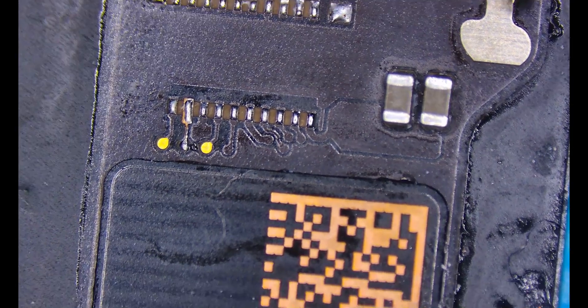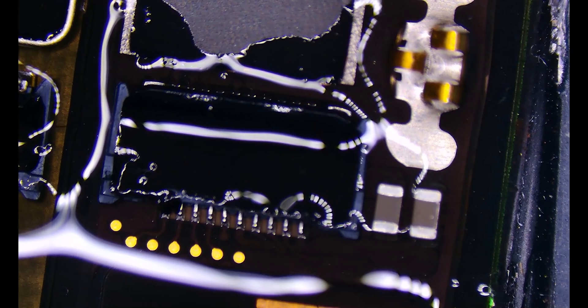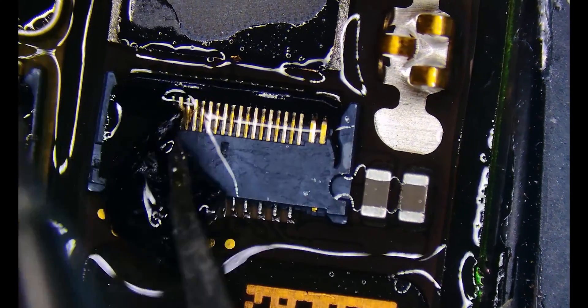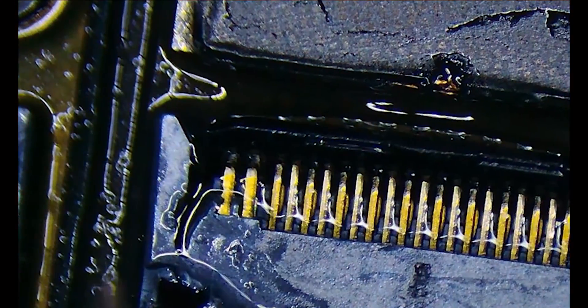If you're liking what you see then smash that like button and subscribe if you haven't already. Looking good, so I'm going to get our new connector — I'm actually going to steal this from a broken display. These connectors aren't something that are readily available, but I do enough watches that I have access to them. Adding isopropyl alcohol I'll be able to carefully remove the sticker and pull it away so that we have access to the clean connector. I need to save this connector so I'm going to be extra careful here when prying out the little arms that hold the swivel points for the actual connector itself, and carefully slide out the flap of the ZIF connector.